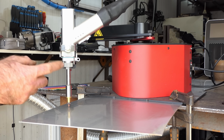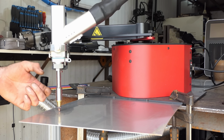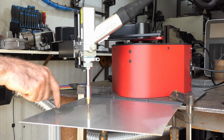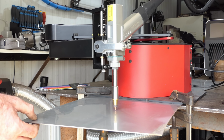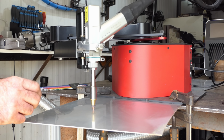And so if you're building your own CNC, all you've got to do is connect those 2 wires to your trigger relay. So when it comes to the business end, you want to create some sort of bracket to hold the torch onto the gantry. I've also included a hard stop specifically for the Arc Droid, because what it does is it wants to probe material. If you've got thin stuff like I do, then it kind of gets distorted. So I'm going to run a few test holes for the stainless steel, make sure I've got my settings just about right. And then we'll cut out the box and see how it comes together.